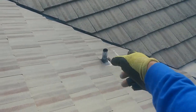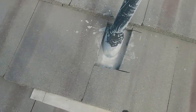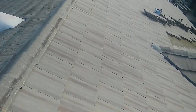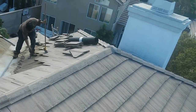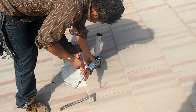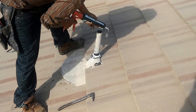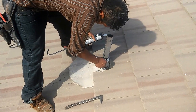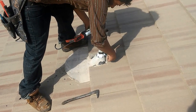Please, next time you do a flat tile, do not use aluminum flashing. If you cover it, it looks ugly — you're supposed to make a cut here to get rid of the debris underneath the tile, otherwise they keep clogging. To do a proper maintenance: remove the old cracked roof cement and apply new silicone. Make sure you use a proven silicone like Novalink or M1 — it's a good one. Apply new silicone to the pipes.